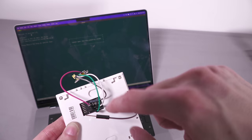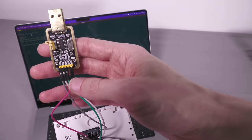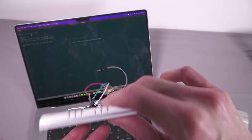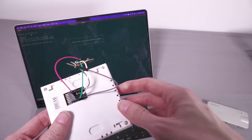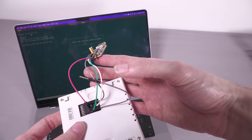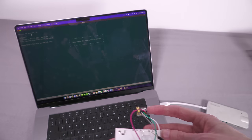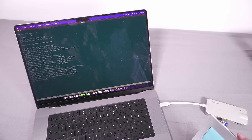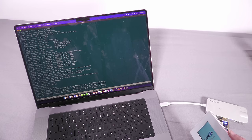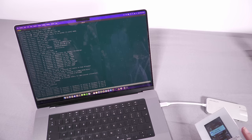You can power it from either 5 V or 3.3 V — there are two different pins. I'm using 5 V to power it because that also powers the LCD, whereas 3.3 V only powers the ESP. With the device connected and plugged into the laptop, you can see in minicom that the device starts up as normal and outputs a lot of debug information over serial. It references a Tuya module not existing, so the firmware is designed to talk to a Tuya module if installed. That's it booting up into the default firmware — but you can't flash it if it's doing that.